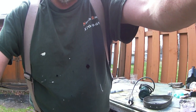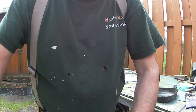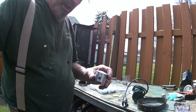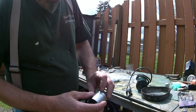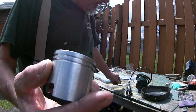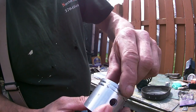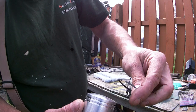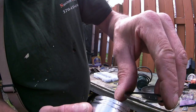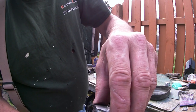I don't like this because the camera's down a little bit. I want to see if I can tilt this forward. The problem that's going along with this, and I want to get your attention, maybe the tripod's going to be a hindrance. When you go to get your new rings, right there, there's a little pip mark right there. You can see that little dot, and then there's one for the bottom, from the bottom compression ring. The open end of the arrow should face up, and that should face down. It's almost like an arrow, but the arrow faces down.